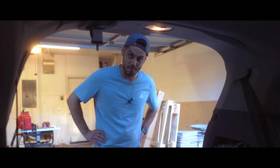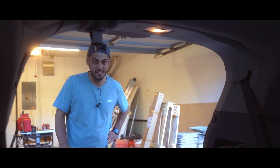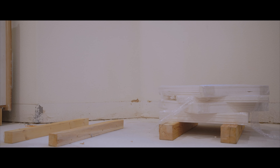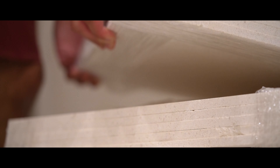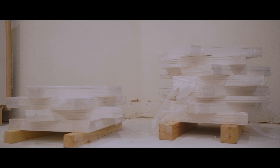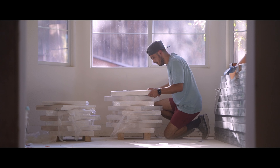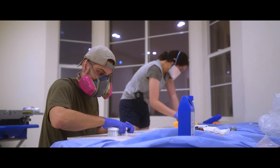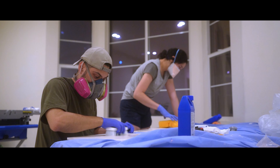Our tiles arrived and this is a lot of tile. It feels really good to be here because it took us so long to select this tile. This is 18-by-18, 180 square feet of Turkish limestone. We finished off last night figuring out the layout for the entire bathroom, and we also cleaned and sealed all the tiles. Because this is limestone, we're a little worried it's going to get thinset stuck to it because it absorbs a lot of water. In terms of the layout, we're going to go with 33% offset. I'm going to go ahead and cut the first tile, mix up thinset, and then we'll get started.